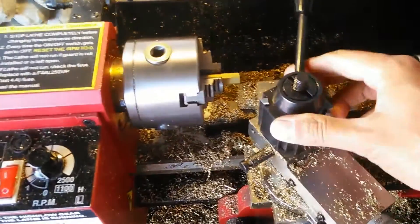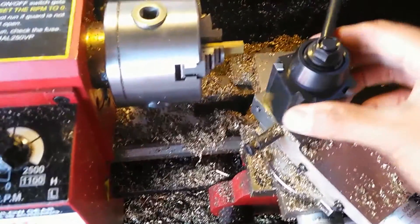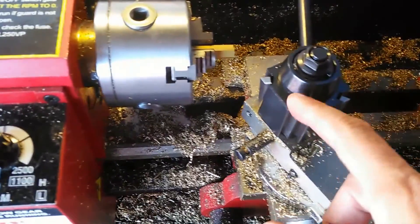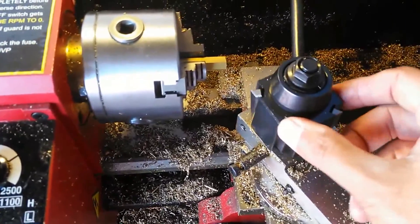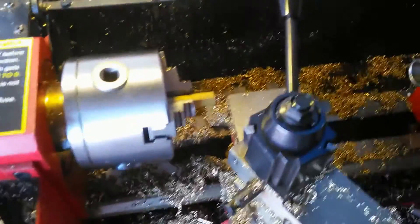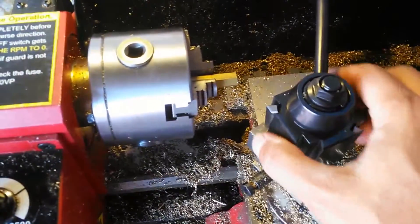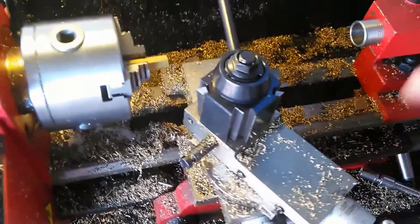I've taken the bottom base piece off and I'm going to put the correct setup for this lathe on. I'll slide it on — it's on. Put the nut on and lock it down. The way this works: you can rotate the tool post by releasing this nut. There are actually two positions where you can orient tools, though you're only using one tool at a time — not entirely sure why they set it up that way, but anyway. This axis locks in, and here's your cross slide, which I currently have set at a 30-degree angle rather than the standard 90.